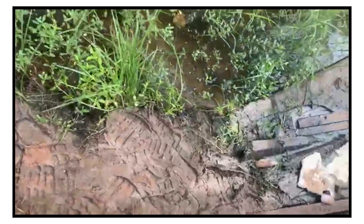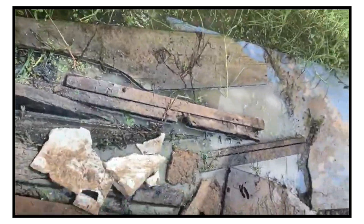With such jobs in waterlogged areas, what you are looking for is the water not returning back into the digester. You need a reliable source for disposing of the wastewater. The other option is to do a French drain or drain flow system, which is exactly what I did for this particular job — we perforated the base of the pipes.